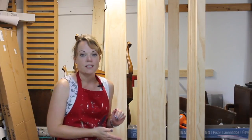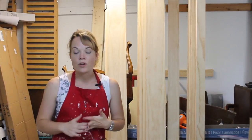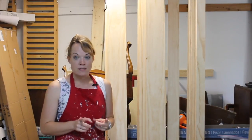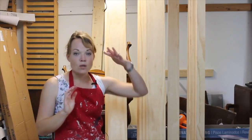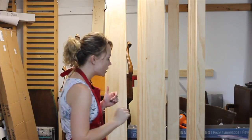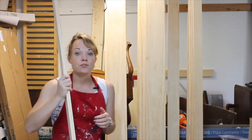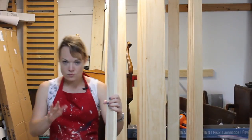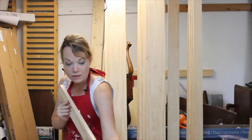If it's in your budget, spend a little bit more and get a really nice cut of wood. Let me show you one other trick: anytime you go to the lumber yard or hardware store, you need to know how to get a straight piece of wood. Especially when building something like a door, you can't have a piece of wood that's bent or crooked — it'll mess up your whole design. All you do is grab your piece and sight your wood — stretch it out in front of you like this.